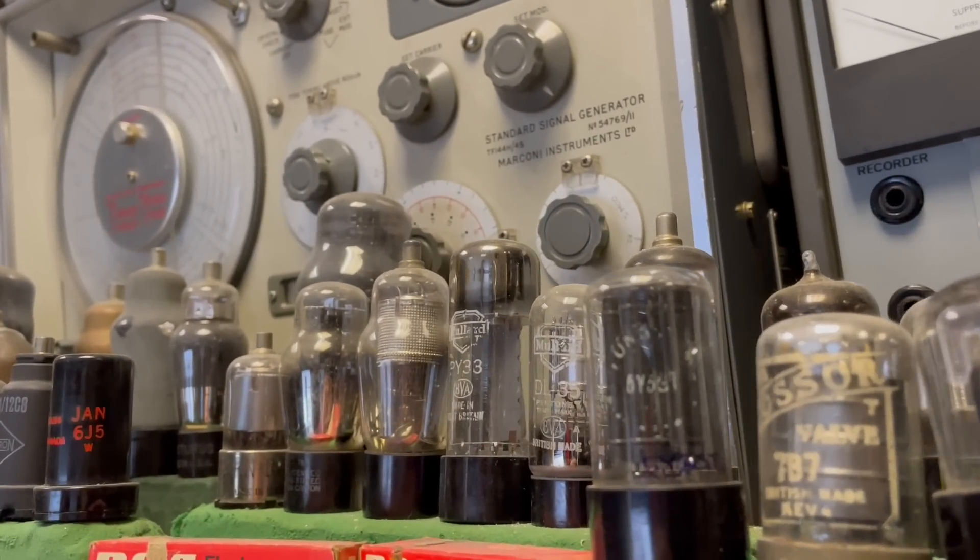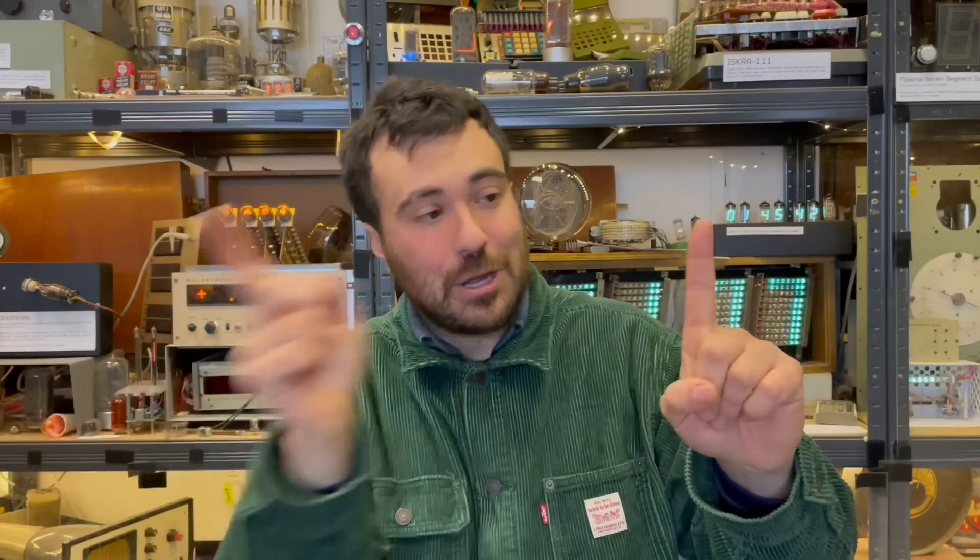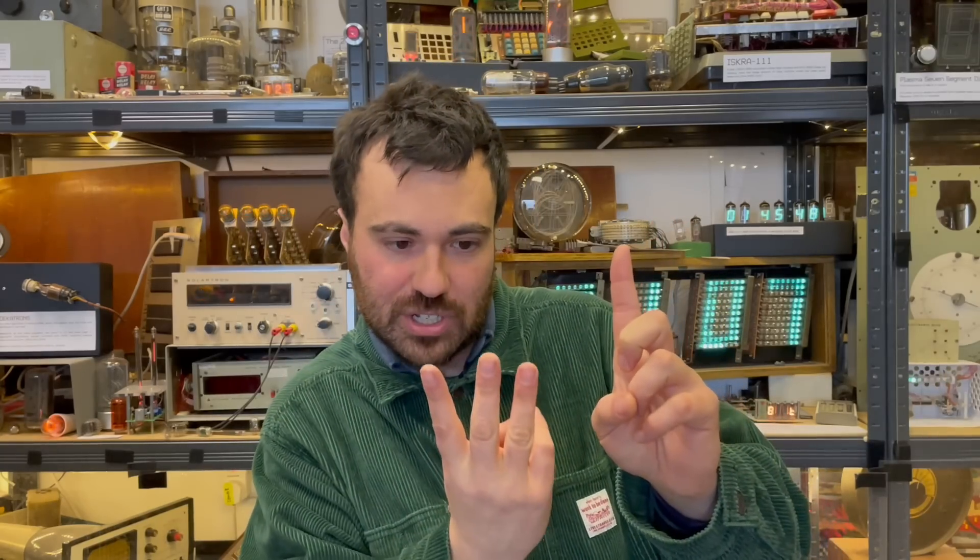The reason why you suck all the air out and make a vacuum is because these things are particle accelerators. You have two electrodes — a cathode and an anode — and because electrons are negatively charged they get pulled like a magnet towards the anode. If you have loads of air in the gap between them they can't get through because they're colliding with all of those molecules, so you suck the air out, make a vacuum, and the electrons can jump across. Then you can introduce different types of electrodes in the gap to control the flow between the cathode and the anode — that's how you make things like amplifiers, which means we could have things like the Beatles and all sorts of amazing stuff.